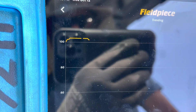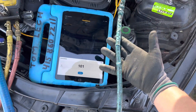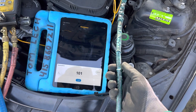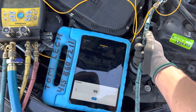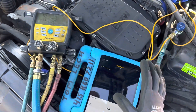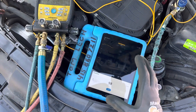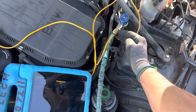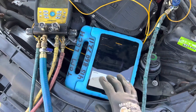Compare this to the other videos on other vehicles that were highly moisture contaminated. The biggest problem is we are also reading the lack of ability of rubber refrigerant hoses to hold a low vacuum — they have moisture contamination within the lining. So when I turn off the vacuum source, this will soar up and you'll be reading what is in the rubber hoses, which you shouldn't be reading. But as an introduction, this is the best way to learn at an economy price — you get a good set of gauges with a micron gauge built inside, and this is where you can start honing your usage before you purchase a standalone micron gauge that you can valve off and separate from your refrigerant hoses.